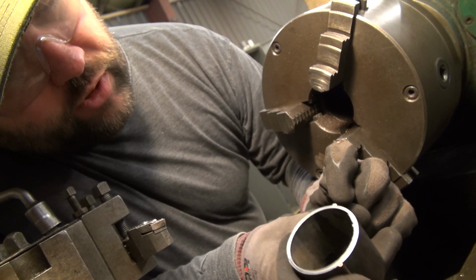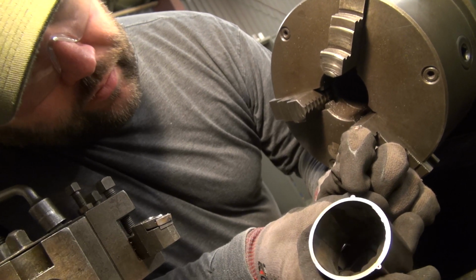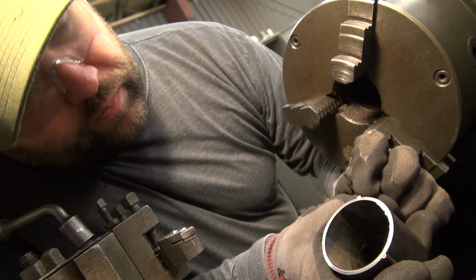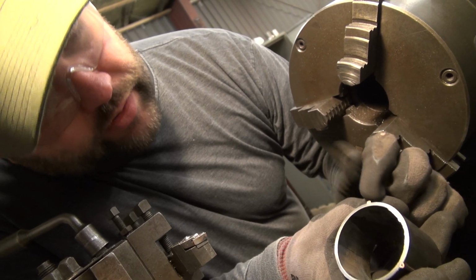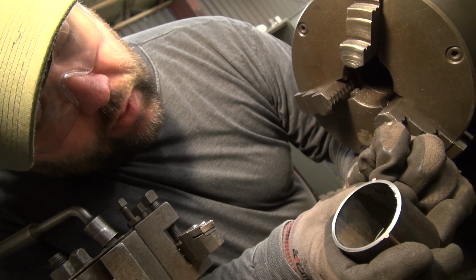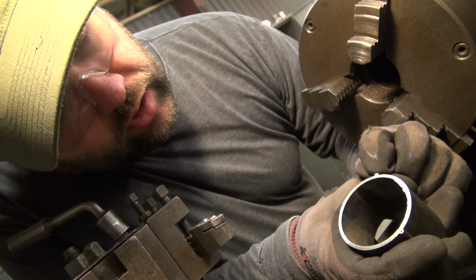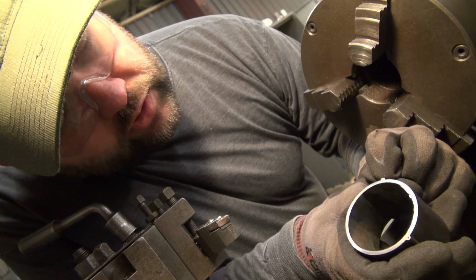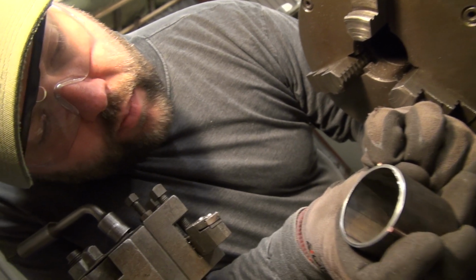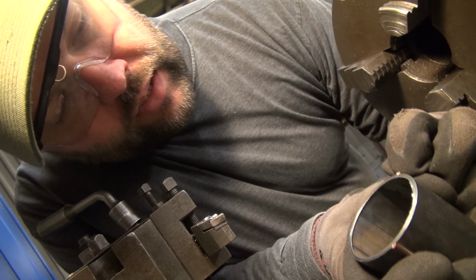This one here is pretty evident. It seems that where we cut this test tube, completely arbitrarily, it looks like we bumped into an air bubble or a gas bubble inside this little copper tube. The silver soldering material is quite visible down there, but there is also a cavity.